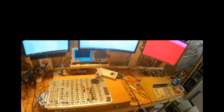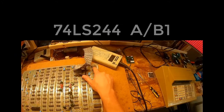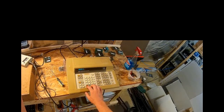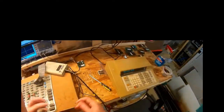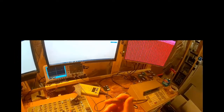Going forward, the first thing address bit 1 hits after it leaves the CPU is buffer chip AB1 — a 74LS244 — and it should hit at pin 6. I'm going to do a write to address 0 in a loop, writing 0x55 continuously, so I can see how the signal looks when it hits the buffer. The write line going low will be my trigger point.